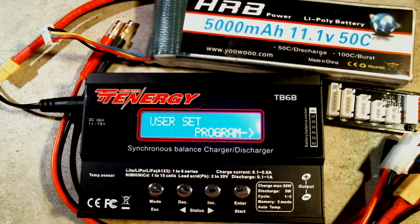When purchasing your charger, calculate the charge current it can provide by dividing its power rating by your battery's voltage, and make sure it meets your desired charge rate — remembering that battery voltage increases as it charges and efficiency losses occur. It may be worth buying a charger with a very high power rating since they aren't much more expensive than lower-rated ones, and you'll be able to charge a greater variety of batteries at multiple C ratings. However, only do that if you plan on building larger drones that require batteries with higher charge rates.